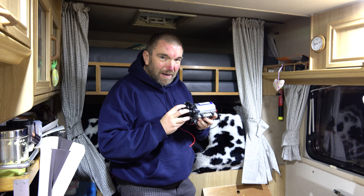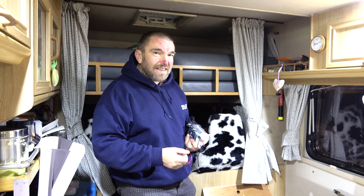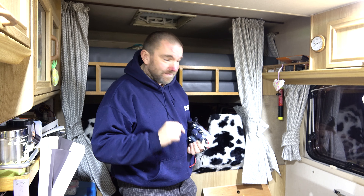The shower hose had frozen as well, and that hangs in a big loop, so there's another tip for you: disconnect your shower hose and drain that off too. I've now done that and hopefully it's okay. Before we go away, when the weather warms up a bit — I think it'll get milder this weekend — I'm going to put some water in the tank and fire up the pump, because I already think I had a little weep somewhere, as the pump was firing very occasionally when left running.